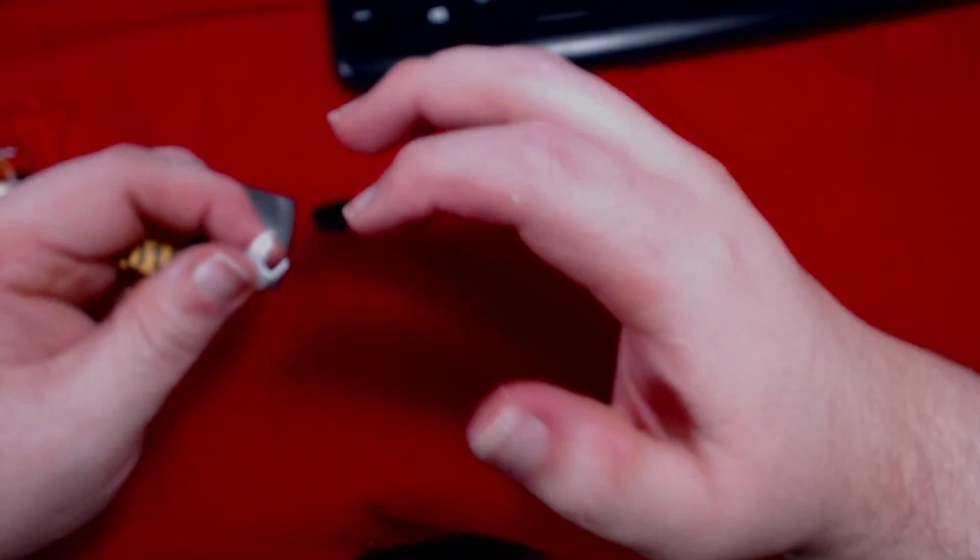And see, here's the thing. You will go through sandpaper, right? But keep those little scraps, because as you use them and more of that sand comes off, they get less grit. Sometimes that used, soft bit of sandpaper is good just to take off a little bit more when you don't want it quite as aggressive or abrasive as when you first started. It sounds weird because you're like, well, you're already at 1000 grit, how much less aggressive do you really want it to be? Sometimes taking an old bit of sandpaper is just what the doctor ordered.